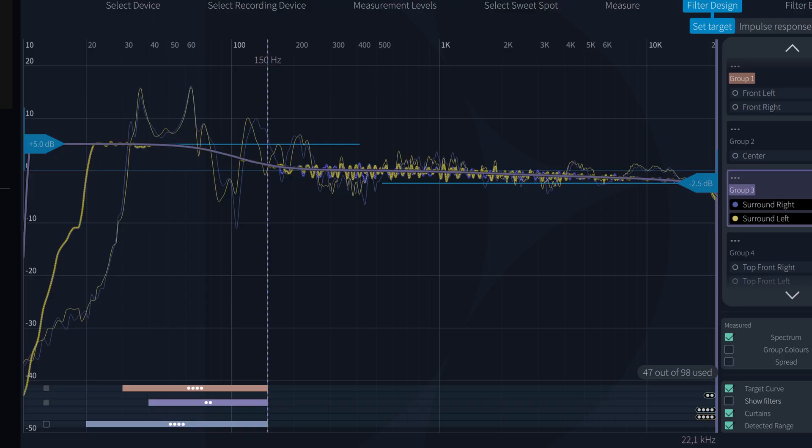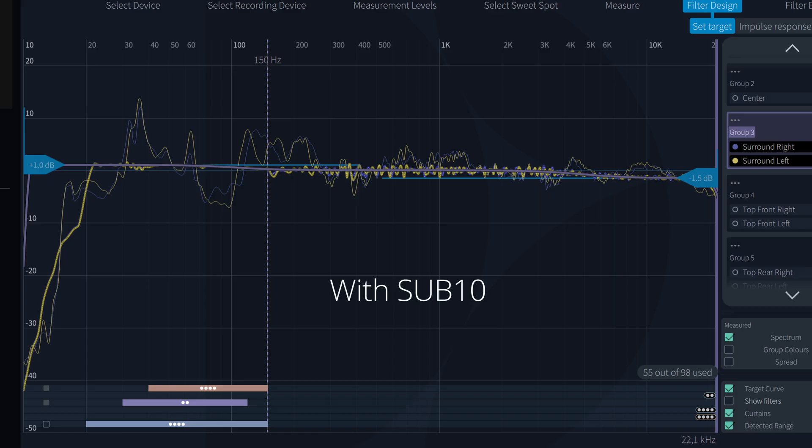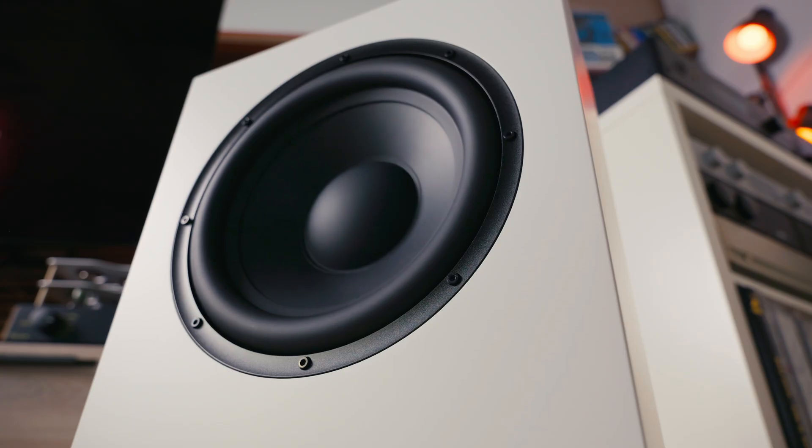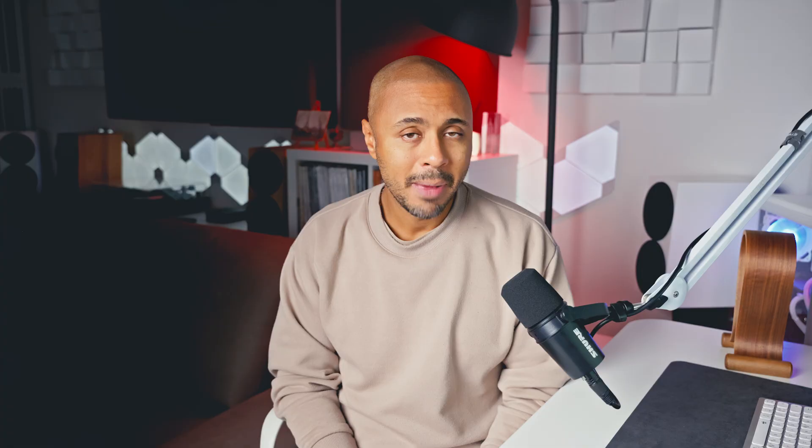So it's not plug and play — it will take you a bit of time, but it's not impossible. Here you can see the surround extension shifted from about 30 Hz down to 16 Hz in the room, effectively making the surrounds behave full range with better control and headroom. With this type of setup, you keep most of the impact of all subs in one group, gaining the cleanliness of the split configuration, and adding better integration across channels. Overall, it's the best balance in my opinion — punchy, controlled, and immersive, with fewer trade-offs.